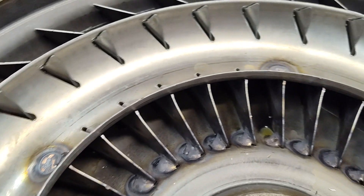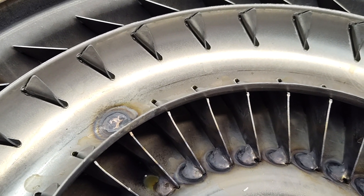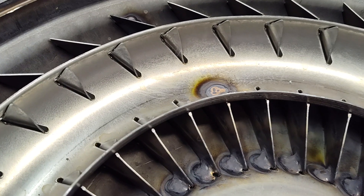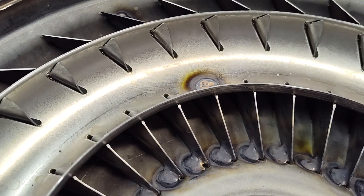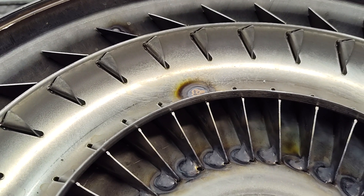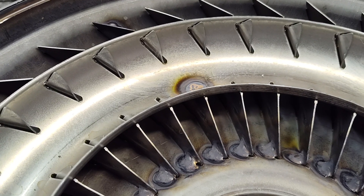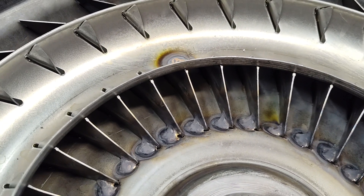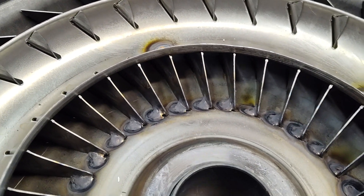I just wanted to show you this real quick because a lot of people say, 'What's welded fins? Why am I paying for that? What does that mean? What's furnace brazed?' I want to tell people: that's okay if you don't want to buy a converter from us, but just make sure you don't fall into the trap of 'wow, here's a converter for $75.' It may not hold up for what you're doing. Don't buy an 800-horsepower-rated transmission and buy a $75 converter for it, because it's just going to fall apart, and when all this metal goes through the internals, well, that's junk too now. Kind of a penny wise, pound foolish deal on that one.